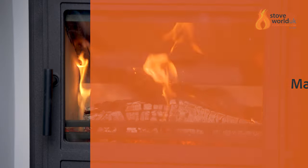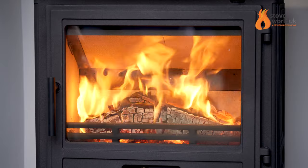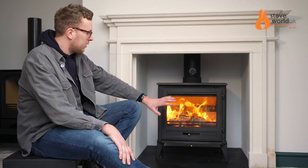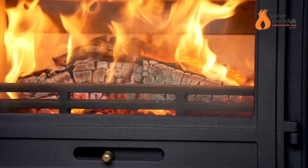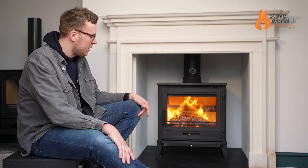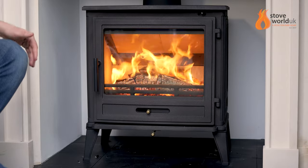Maintenance and daily use. So it's fairly easy to maintain. Inside you've got the standard fire brick lining — we do stock these, but they are just vermiculite boards, very easy to cut with a wood saw or jigsaw. The grate and everything is replaceable too. For general day-to-day use, because it's a wood burning only stove, I'd suggest just leaving a little bit of a bed of ash so some air can get in when you first light the stove — only clean the ash pan out every so often, it just doesn't need cleaning out daily. Leaving the bed of ash also helps to protect the grate and prolong it. All the inside baffle plates are removable, so when the chimney sweep comes they can all be popped out and put back in again.